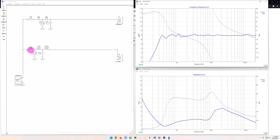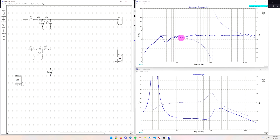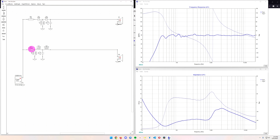I added two components at the beginning — a capacitor and an inductor. Without them, the curve looks different. The capacitor is probably not practical because it's way too big and they don't make good audio-quality capacitors in that size. But I'm curious to see what it does — it tames the impedance curve quite a lot, dropping it way lower. It also decreases the sound level slightly but brings up the response around 35 Hz quite a bit.